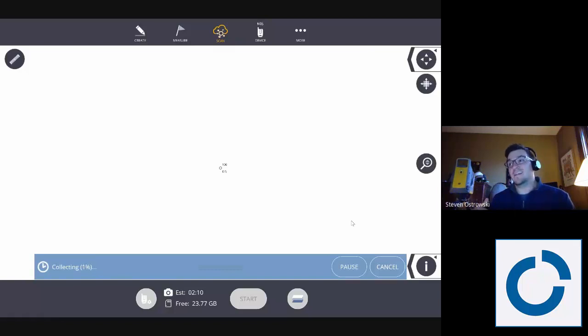The scanner also has a laser pointer so you can use it to resect like you would a GPS. I'm using FieldLink — the same building layout software used on our RTS systems or with our 986 GPS receiver outdoors — but here I'm bringing in scan data to reference, align, and process. If I wanted to, I could use the X7 just like an RTS out in the field. Right now it's scanning, with a little rotating mirror on the inside picking up around a million points.